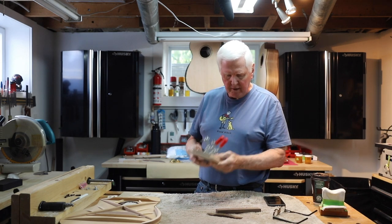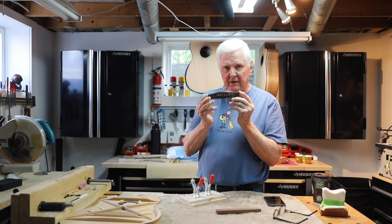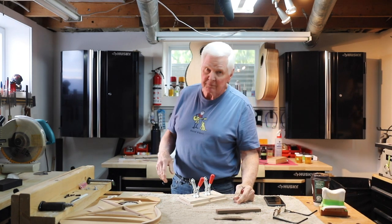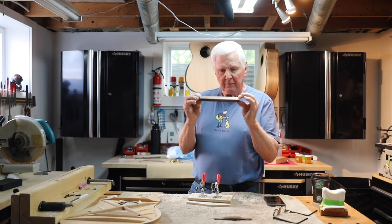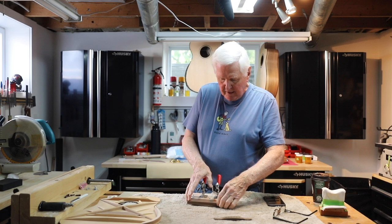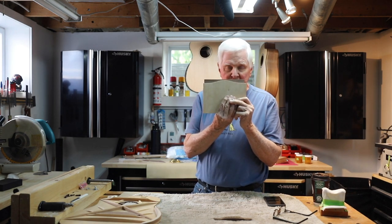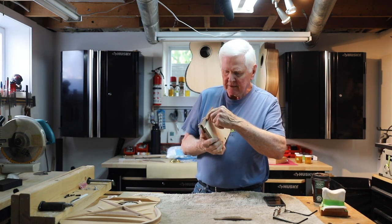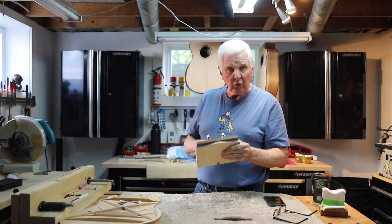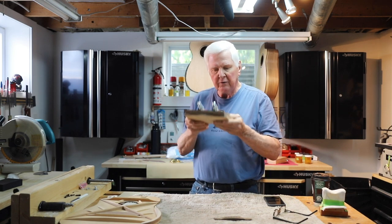I've got three and a quarter here, three and a quarter here, because the bridge that I'm using is six inches from this tip to this tip. They are cut inward by about five degrees — just aesthetic, sometimes I do it, sometimes I don't, it doesn't matter. So you simply take a piece, a block of wood that's going to be your bridge — it's about an inch and a half deep, about six and a half inches wide. You put it in here, draw the pattern — you can see the shape that it's going to be. I'll use a white pencil since it's dark wood, and then take it over to the band saw and just nip it, not right down to the line. I want it back of the line because I'm going to do this on the router.